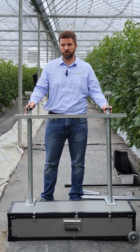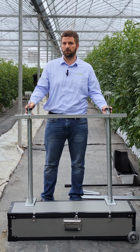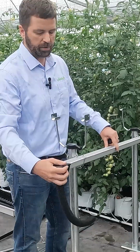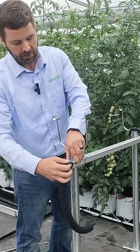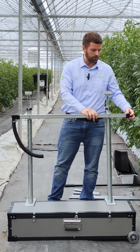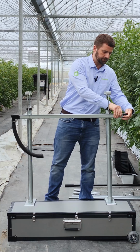For today's demonstration, the post spacing is only 1 meter, but in typical installation, we recommend a 3-meter spacing between the posts. After hanging the metal gutter in the bracket, you put a bead of glue inside the cap and then slide it onto the end of the gutter. This cap is to protect workers or anybody else from damaging the end of the gutter.